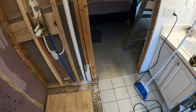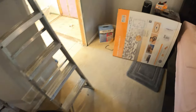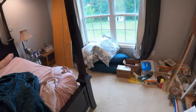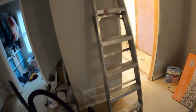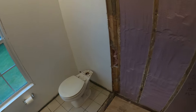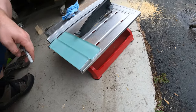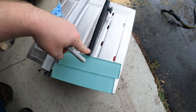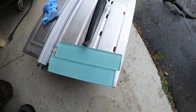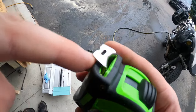One thing I want to set up is some practice tiles. I'm going to cut a couple of these in half just to check the saw out, and at the same time we'll take a piece of scrap board, lop a little rectangle off it, and use thinset to mount a couple of tiles. Then we'll peel one up each day and just see how they're bonding. Here's the little tile saw — it's got a tiny water reservoir which I should probably clean. It's got a blade for glass and I set the guard at four inches for these eight-inch tiles.